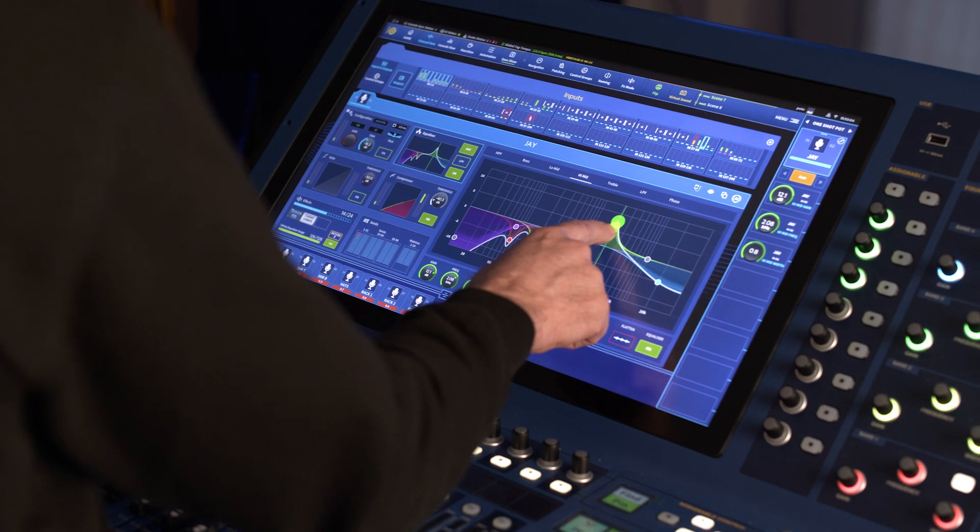Our delay compensation was originally introduced with the XL8 and continued through the Pro Series and obviously HD. This means your audio can remain phase coherent and unaffected throughout the processing chain. But unfortunately, even Midas must obey the laws of physics and you can't stop phase shifting through traditional filtering.